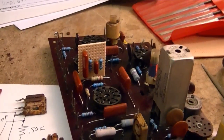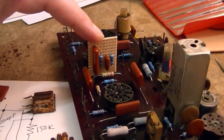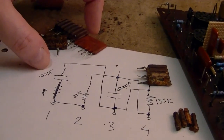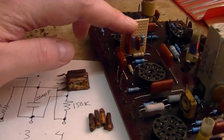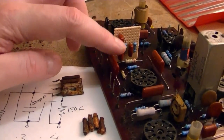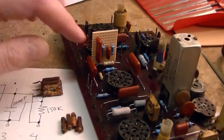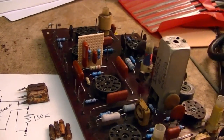Which leaves us with the capacitors. For this guy, I used plastic film, just like I've used elsewhere. These are larger values, 2200 and 1500. And this one in particular hooks up right up to this guy, and they form a sort of AC voltage divider. And it was recommended online that you use the same identical cap for both. So, plastic film, stable with regards to temperature. I don't think I need super precise 1% accuracy on the values, so I think they'll be just fine.